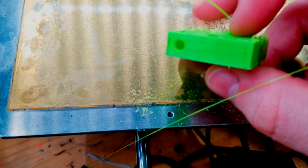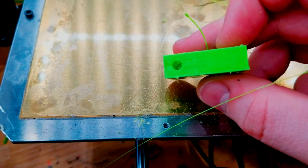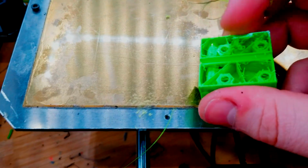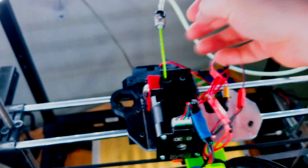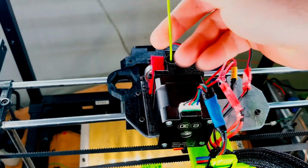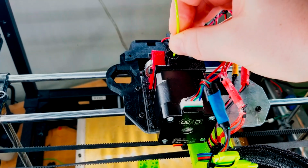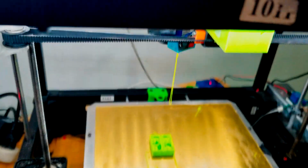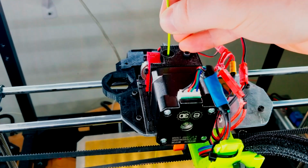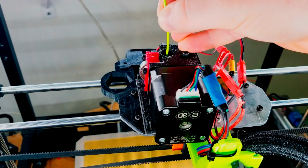I've had a bunch of these come out where you can kind of start to see very poor layer adhesion, not enough filament coming out here. That surface on the hole, the whole shebang, right? So here, my retraction settings are typically 0.5. I go up to 1 millimeter for PETG, right? So here's the thing. This is way hotter than it should be, right? So we got filament coming out the bottom here. Drying. Okay. So like 1 millimeter is probably less than this. That's probably more than 1 millimeter, okay?